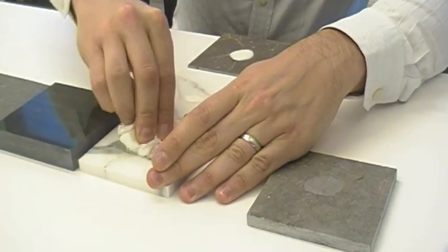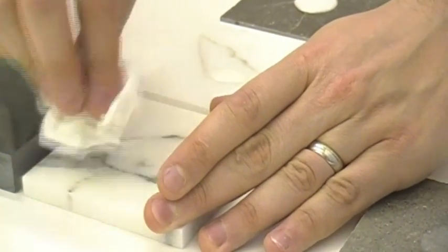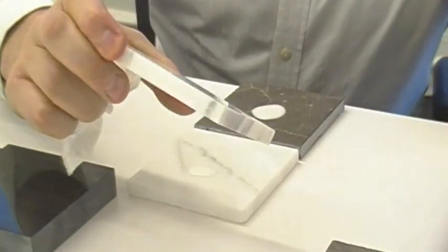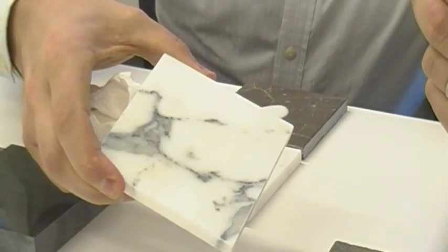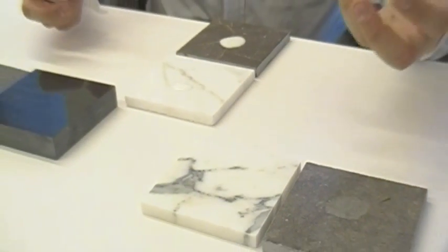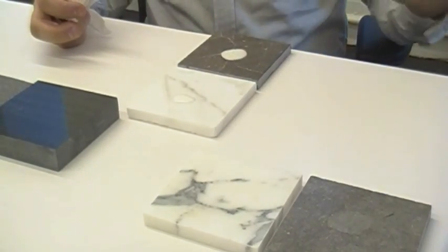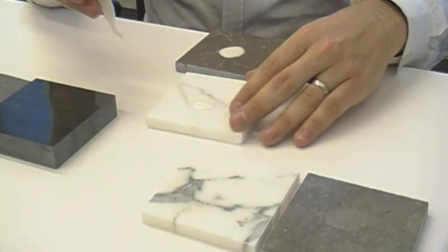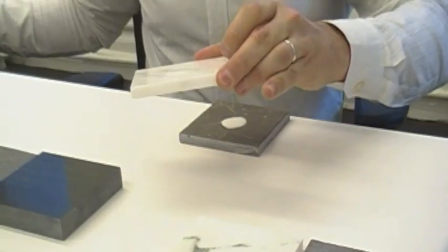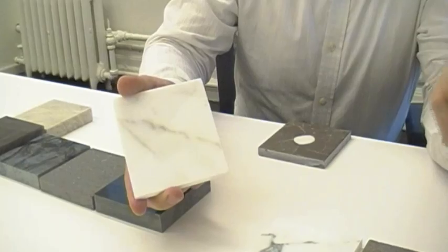The honed marble shows less of a change because it etches white. It doesn't mean it reacts any less to acid — it just means the aesthetic change is not as apparent as it would be on a darker material with the same mineral makeup. A high percentage of calcium and magnesium carbonate is what that organic matter becomes when it becomes stone, and that's what's reacting to the acid. You find calcium carbonate in things like aspirin, toothpaste, soy milk, and almond milk — it's a lot of the calcium in those, and it's because it will react with your stomach acid and dissolve.